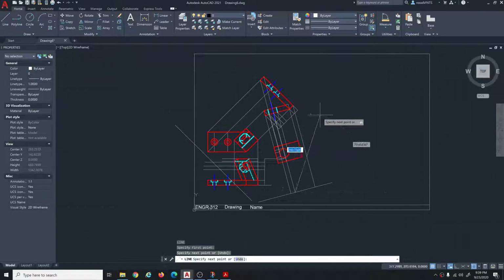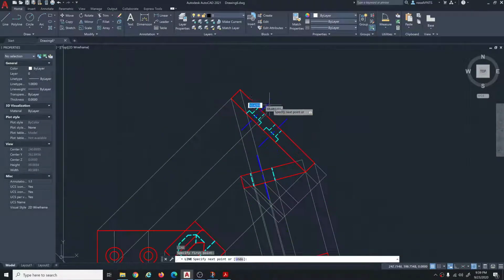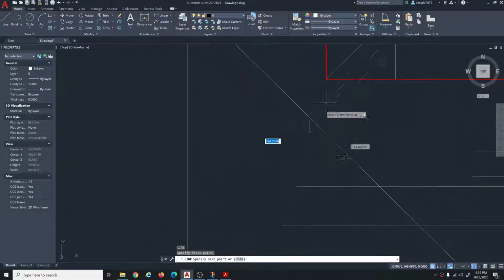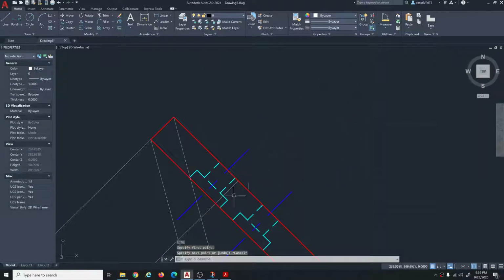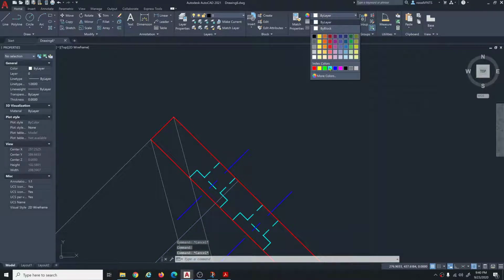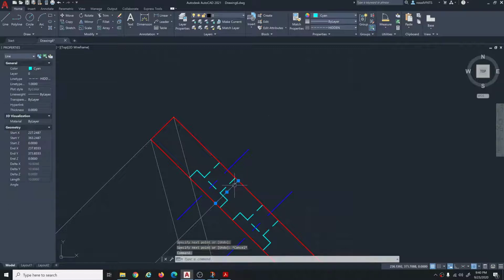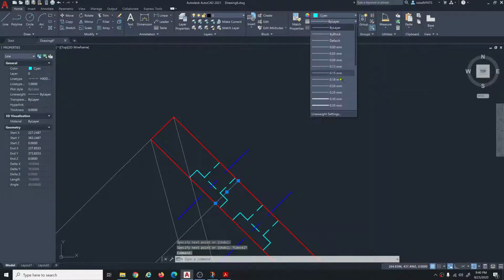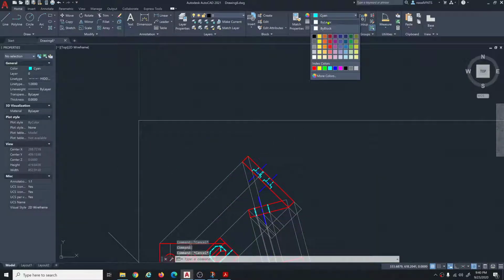And there's a couple of points in here. Look, here, right? The ones that come from this corner right in here, right? But that comes all the way through back. You know what? That's a hidden line. Right in here, there should be a hidden line. That's the back edge. I'm gonna go ahead and draw that because I just want to point out that that's what's going on there. Okay, there's a hidden line in the back edge of that, which now we need to project from over.